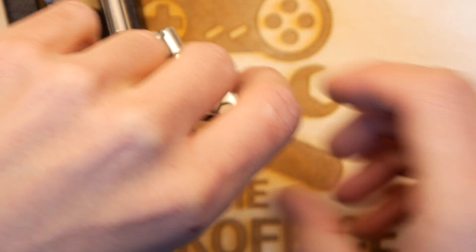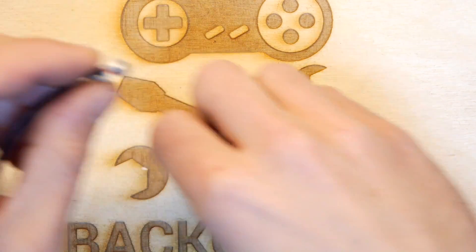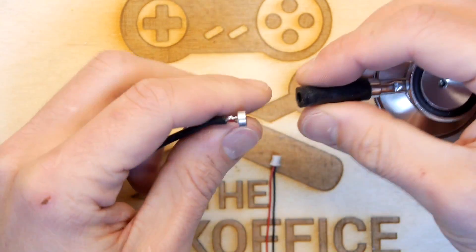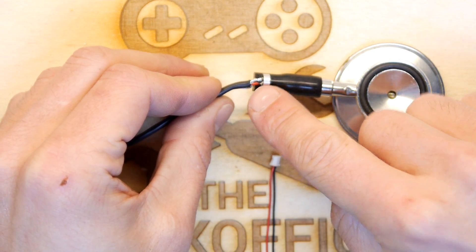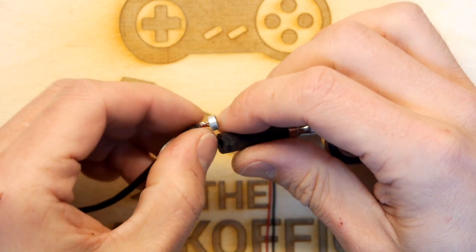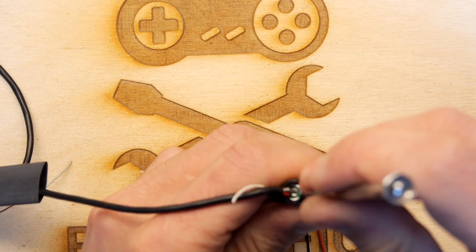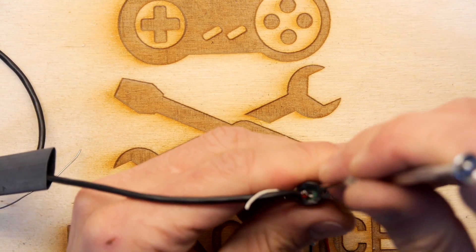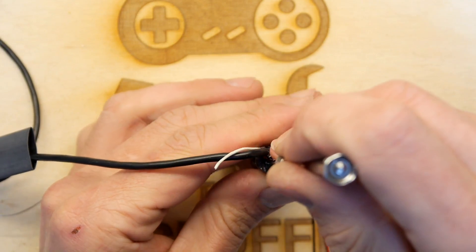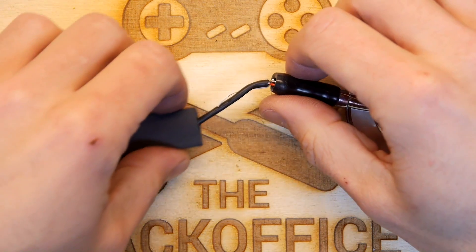Attaching the new wires now. Try not to hold the soldering iron on there too long because you might melt the innards - there is a little circuit board inside, sometimes with a tiny transistor. Now I just want to push that into the silicone tube and heat shrink over it for strain relief. You could also inject some hot glue to make it super strong and permanent - I might do that if it ever breaks, but not yet in case it doesn't work or I want to hook up the second channel. Doctors do listen in several areas, so I'm wondering if you could have more than one probe.